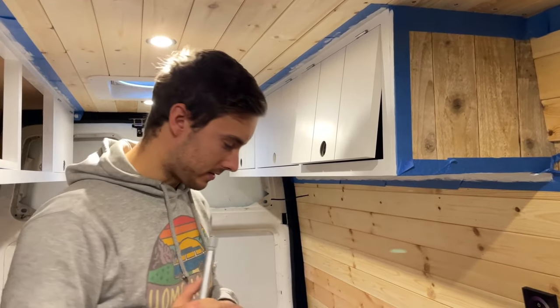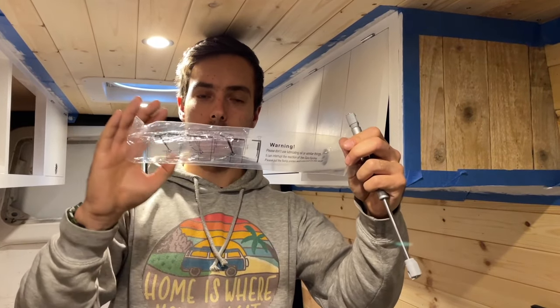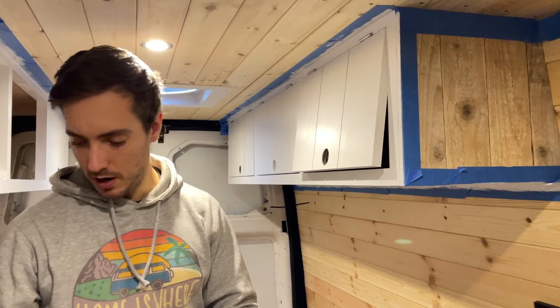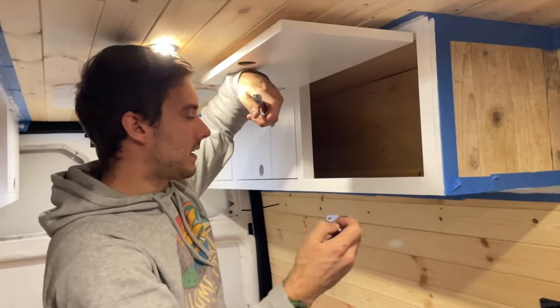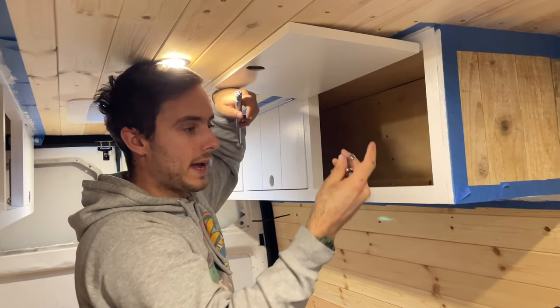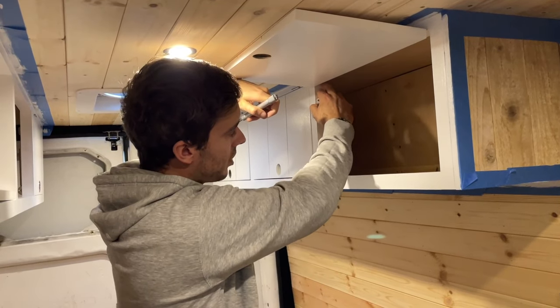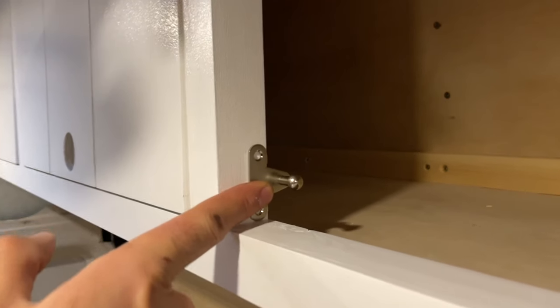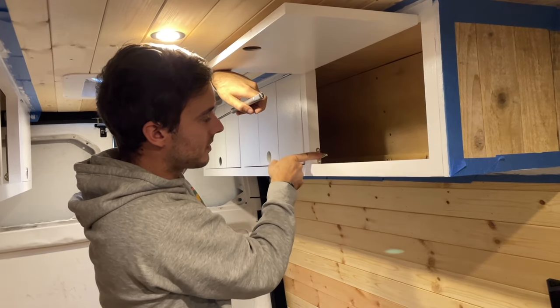You can look at the measurements and they actually come on the bag — if you look on the side of the bag, they're written on there. If not, they're usually included in some kind of paper format. These have to go down 255 millimetres to the centre of the ball, and conveniently these cupboards are 275 millimetres. So all I have to do is rest the bottom plate on the bottom of my cupboard. If you didn't, you'd want to measure down from the top 255 millimetres to find your centre point. I'm just very lucky these happen to be the right height.